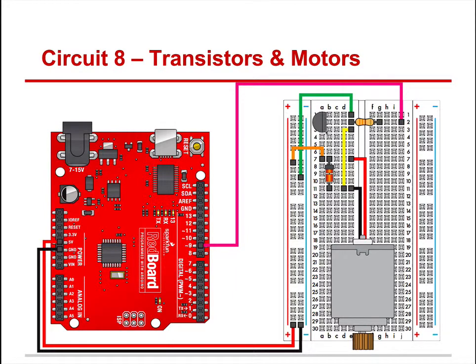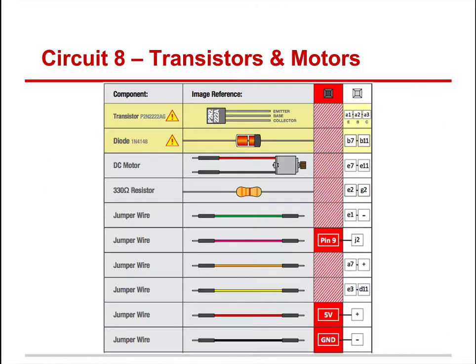And this is our transistor. Notice that there's a straight edge here and it's curved there, so make sure you put it in that orientation. Okay, go ahead and do that: pause this, do this, and then move forward.